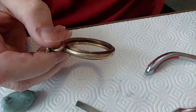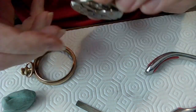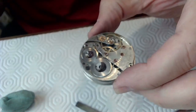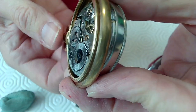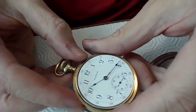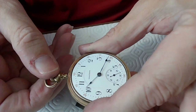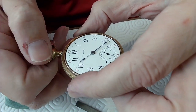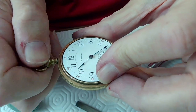Now the question is will the watch work — if it doesn't I've got to have a plan D, E, or F. Let me turn the watch around nice and easy, don't touch anything — it's still ticking beautifully, I'm very proud of the repair. I've got to see if it sits in there nicely now. Drop it in, make sure you get the crown in good contact, then drop in the movement. It doesn't seem to be engaging properly — oh, it's got a bit of engagement there. Press that in — yep, it's winding!